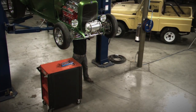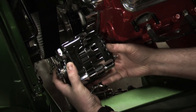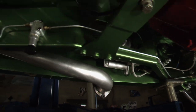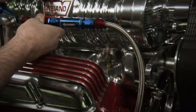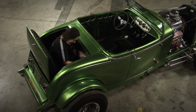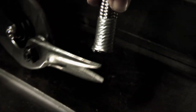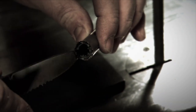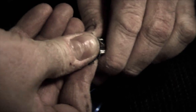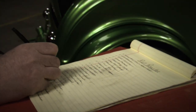At this point, the project was rolling down the home stretch of final assembly. This is where we took care of things like steering linkage, alternator clearance, plumbing the brake and fuel lines, and installing a prototype wiring harness from Electronic Prototypes. Now, since these final details are time-consuming and tedious, this is where a lot of people get discouraged and give up, or get in a hurry and mess up. The key here is to take your time and keep your eye on the finish line because it's getting close.